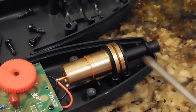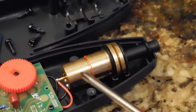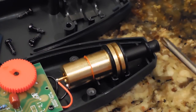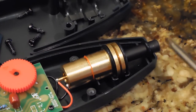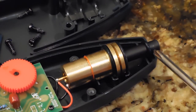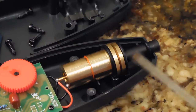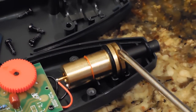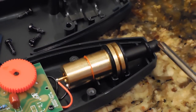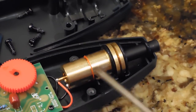This is the section that does all the detecting. It's made up of two parts: the larger brass cylinder, and a smaller section where the antenna or sensing probe screws on, which has what appears to be heat shrink tubing. You have an o-ring that falls into a groove in the molded plastic. Inside there's a molded section where the two halves come together — they simply touch each other, and vibrations from the probe are transmitted all the way through into this piece. These two pieces vibrate together and the signal is picked up in this section.